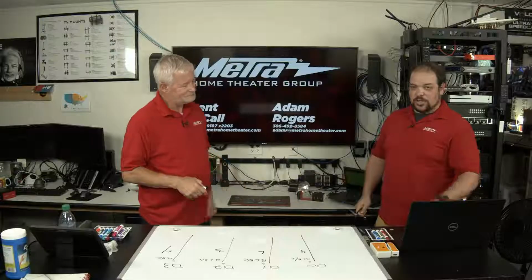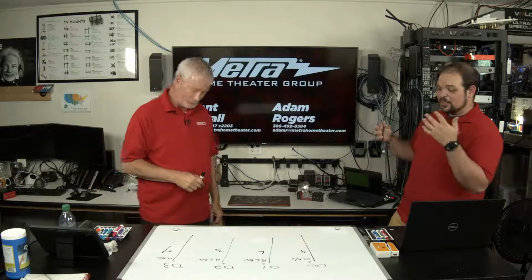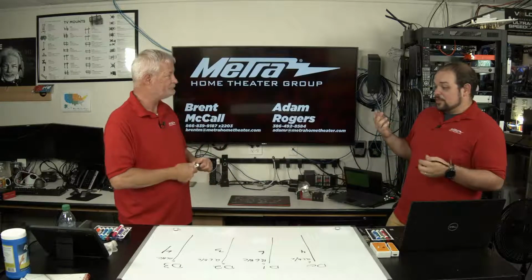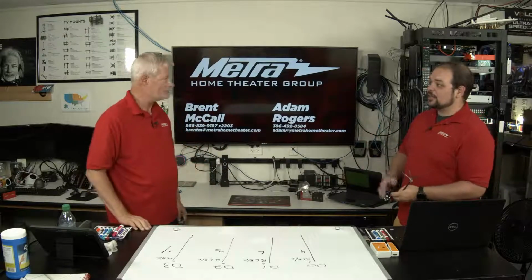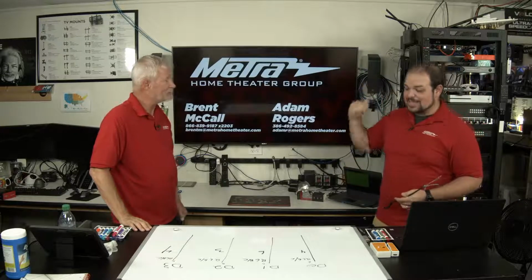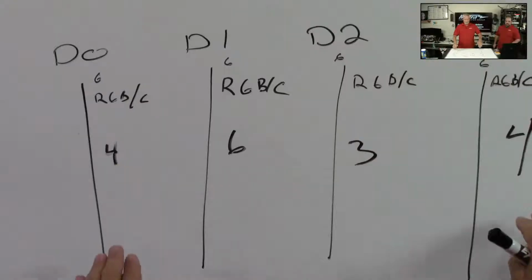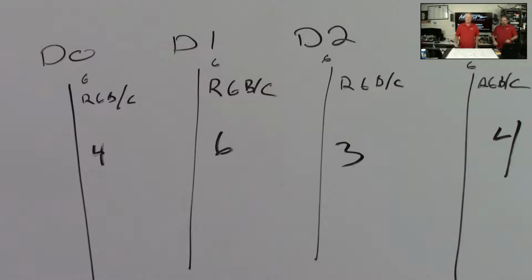Nothing had changed except that they were tired of getting yelled at, which is why we still use DPL. DPL fully does eye pattern testing, and they're a governing body of some kind that we can actually go to and say we need to make sure it meets these standards. So we're going to get back to stuff that doesn't quite meet the real standards, but still meets the certification standards. Here's what HDMI is doing under the current lax CTS rules.